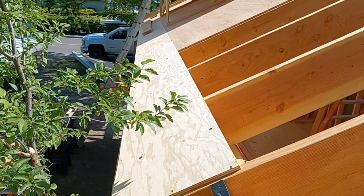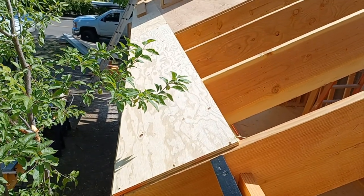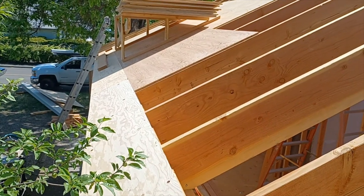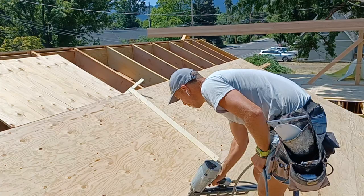Here's just a quick example of our starter strip. This is the expensive AC 5/8s — the bottom of it is perfectly smooth, sanded, and paint-ready. Then we used a little bit rougher material CDX, which is about half the price, for our main sheets.